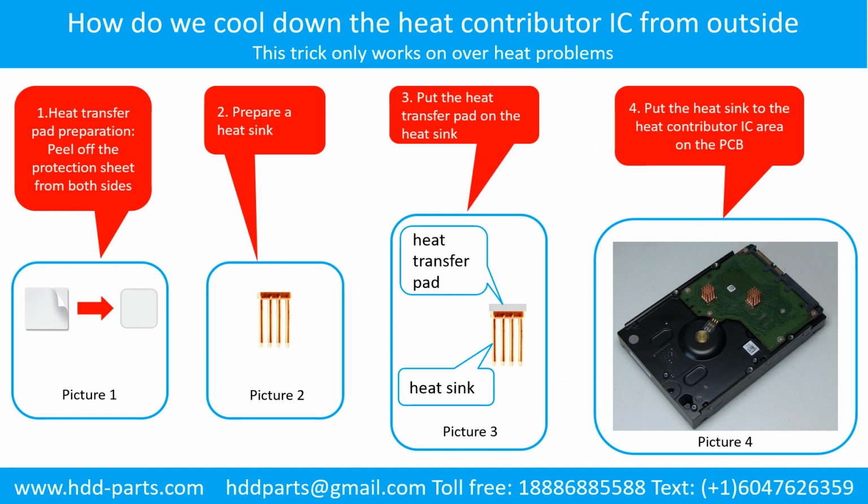How do we cool down the heat contributor IC from the outside? Step 1. Heat transfer pad preparation. Peel off the protection sheet from both sides of the heat transfer pad, like picture 1 shows. Step 2. Prepare a heat sink, like picture 2 shows. Step 3. Put the heat transfer pad onto the heat sink, like picture 3 shows. Step 4. Put the heat sink on the heat contributor IC area on the PCB, like picture 4 shows.